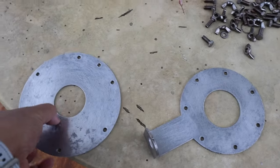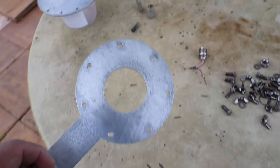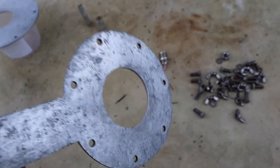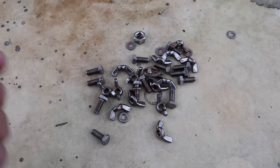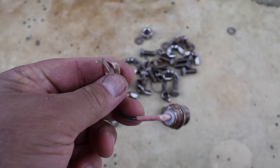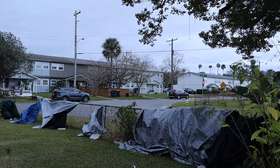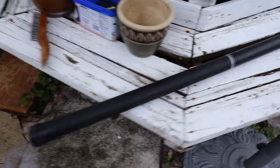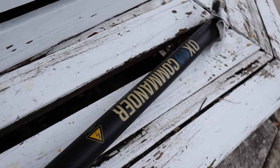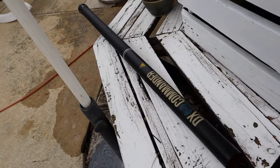I've cleaned my radiating plates and my ground plates — it's all clean with a little bit of corrosion removed — and all the wing nuts, screws, washers, and the SO239 are all cleaned up. We're running out of daylight; the sun is already set and it's gray skies. Here's my antenna — I collapsed it and put some WD-40 in between the seams so I can collapse it easily.